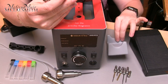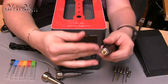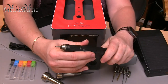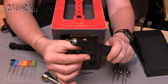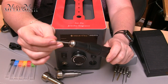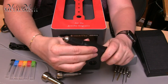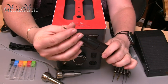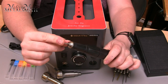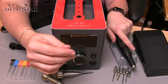The micromotor comes with a plastic cradle, so you should make sure you store it in there. This is a quick change, which means there's a 3/32-inch collet installed. To open this, all I have to do is turn the top part, pull out my mandrel or accessory, and then put a new one in. It's always important with a quick change handpiece that you always store some kind of mandrel or accessory inside of it. It will come with a blank mandrel — just make certain you've always got something in there when not in use.